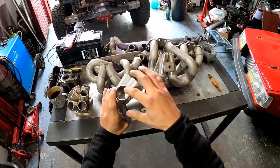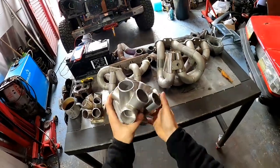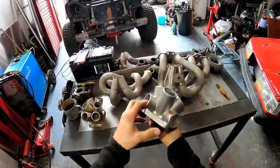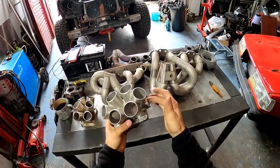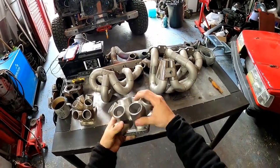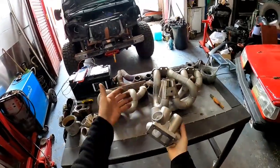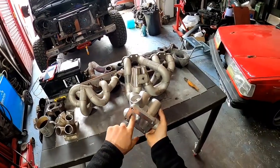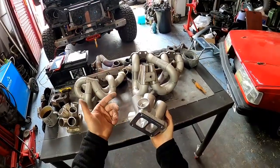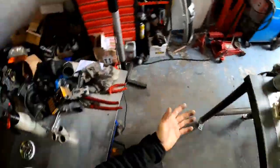And obviously they give you these ports with a blank at the moment, because you can choose your wastegates then. However, I don't understand why they have 2 of them on this side and 1 on this side, because on a twin scroll exhaust manifold you have to have 2 wastegate exits, because obviously they're separated. You can't just have a wastegate on one side, because the other scroll, so the 4th, 5th, and 6th, or 1, 2, and 3 exhaust gases, are still going to push the turbo without being wastegated, which is going to be bad. So I think this roughly covers it.